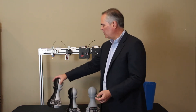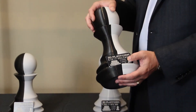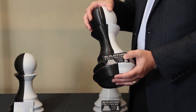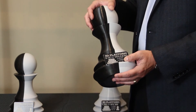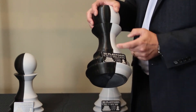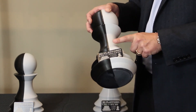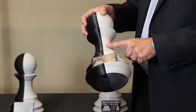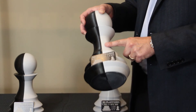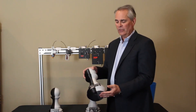Now as an alternative, by going to a larger nozzle — a 1.2mm nozzle with a layer height of 0.84mm — we were able to shrink our print time down to 11 hours and 30 minutes. Now the surface finish is not as fine, but if you'll notice on this other side, by utilizing industry standard auto body paint from Pittsburgh Paint and Glass, we were able to achieve the same finish that you would find on your automotive bumpers, hoods, and the like.